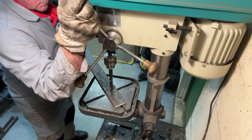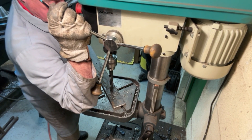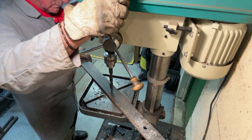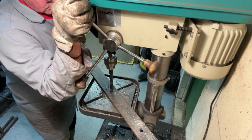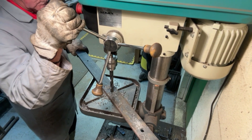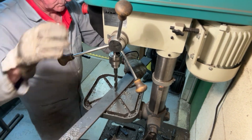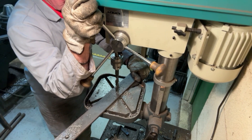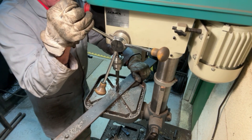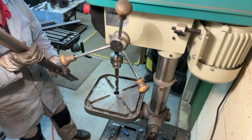I'm opening these holes out to 16 millimeter diameter and they're going through quite nicely. The builder asked me to put 16 mil holes in because he's going to use threaded rod or threaded bar, and he'll set that into the wall in resin so it'll be 100% solid into the wall - hopefully it'll hold the porch on the front of the house. There must be some disturbance underground causing the porch to drop away. They don't do much underpinning here in France, so I'll let him carry on the way he wants.